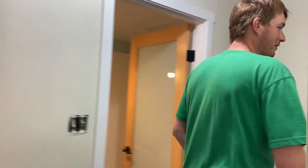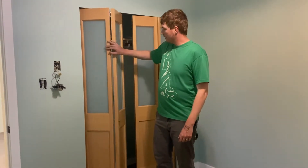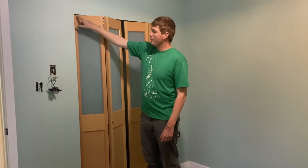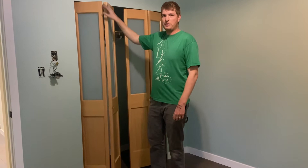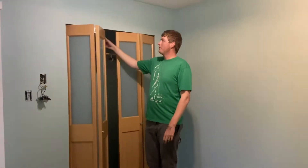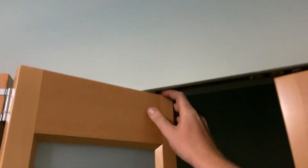Let's look at these doors we've already finished installing. How the bifold door works: there are hinges down the middle, and the door closest to the side of the opening is pinned at the top and bottom. The second door is supported completely by the hinges between the two — nothing else holds it up, it's just an extension of the first door. At the top of the second door there's simply a roller to help hold it vertical, but it holds no weight — it's just a roller guide.